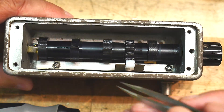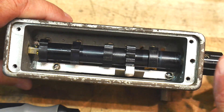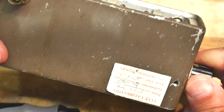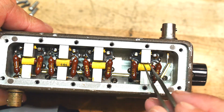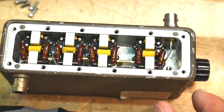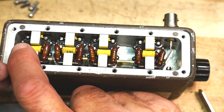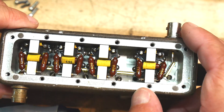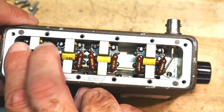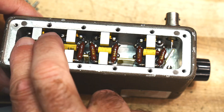On the top we only have 1, 2, 3, 4 cams, so the cams must operate multiple switches at the same time — they're in pairs: 1, 2, 3, 4. So the pairs are clicked in and out. That makes sense. You can imagine these are a PI network — there's two resistors and a resistor across the middle — and you either have this in circuit or you remove it. So the switches are done in pairs.